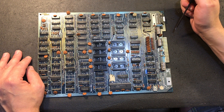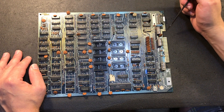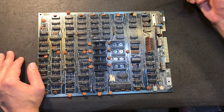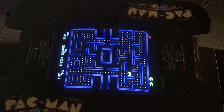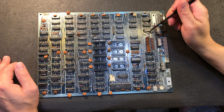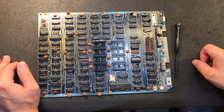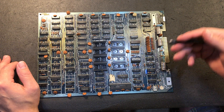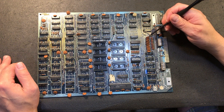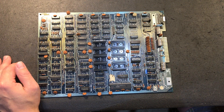What you'll see right here is this jumper. How these boards work - and many arcade boards work - is that a specific input, if we ground that input, ties that circuit to ground, which means the game recognizes it should be a cocktail cabinet. In a cocktail cabinet, when player one and player two switch, the screen rotates, because one player sits on one side and one on the other. A lot of these boards are hardwired for cocktails. Also notable: the test switch is missing - there's no capacitor, no pull-up resistor.